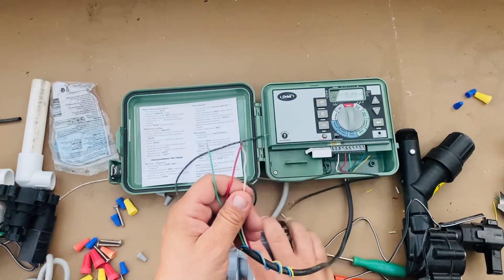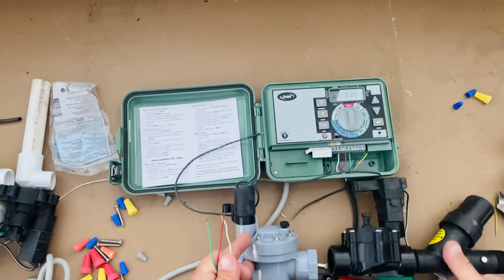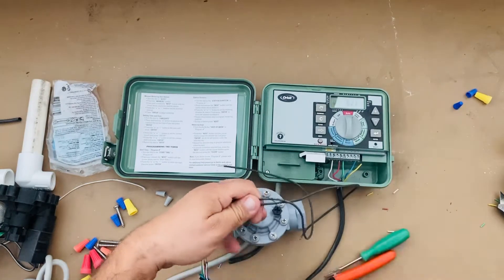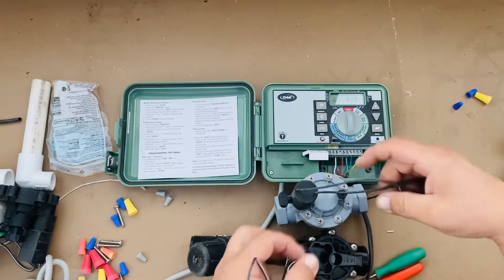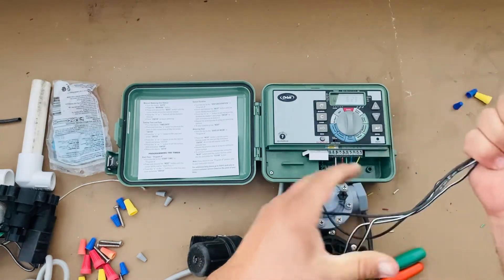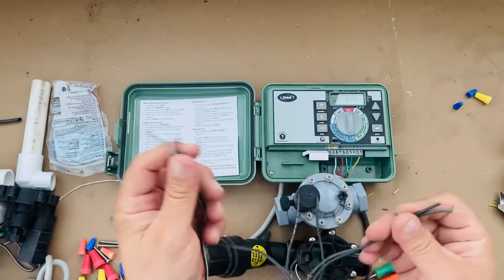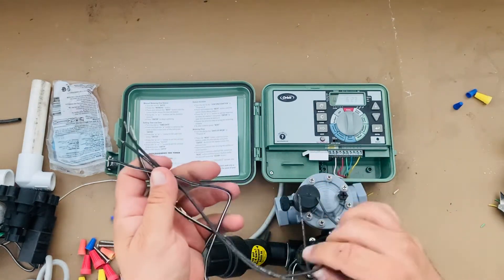The way you wire up the valves — we'll just assume these are in the ground, though obviously they're sitting here on my bench. I'll face them both the same direction as though they're coming out of the box so you can see the solenoids. They're two different brands — it doesn't matter what brand they are as long as they're all the same voltage, which all irrigation valves are. I shouldn't say all — there are some DC ones, so that would be a different case.